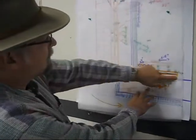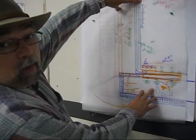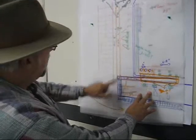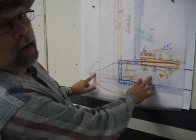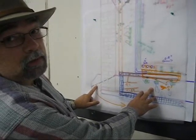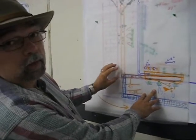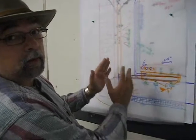By carrying this underneath this new cavity wall system that we're creating, we make a complete seal here. We also have to deal with getting moisture out, and we've modeled this on WUFI software so that we're looking at the amount of moisture we have to contend with, and we're working it down.